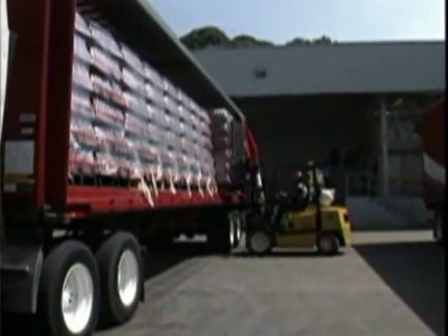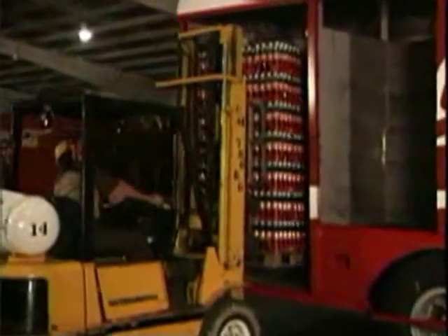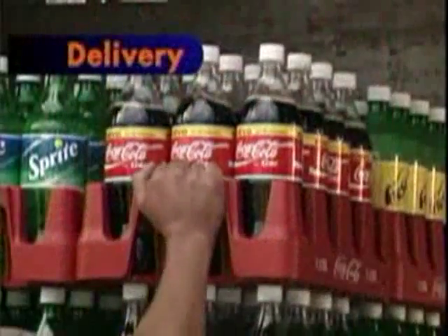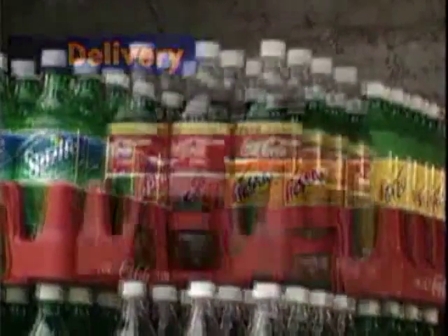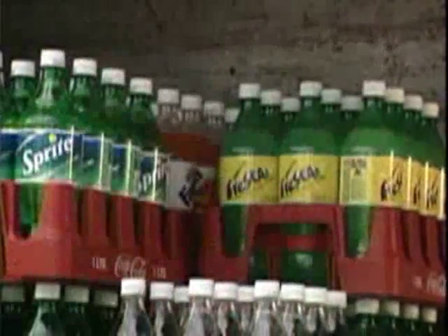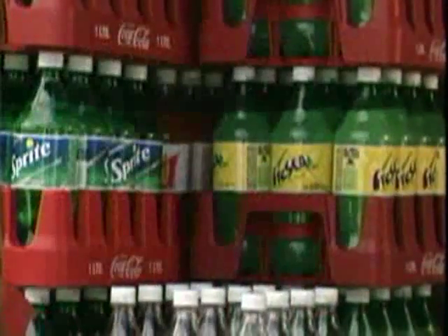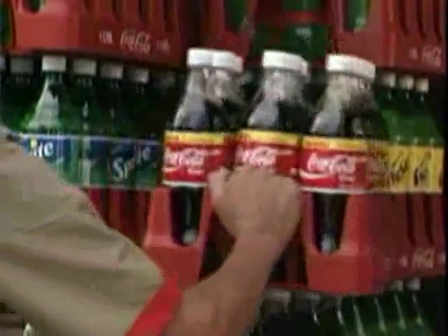For safety reasons, it is important to place pallets side by side with product touching. Bay trucks should be loaded with pallets against the forward wall of each bay, allowing a gap between the trailing edge and the rear wall of each bay. The Merchandiser is designed with the twist and slide bottom to make it easy to pull off a stack. As you grasp the palm-up, palm-down handle, the case can be unseated by simply twisting the case to the side at an angle of approximately two inches. This will unseat the case and allow you to slide it effortlessly across the closures below without damage.